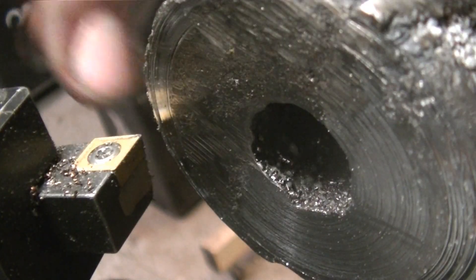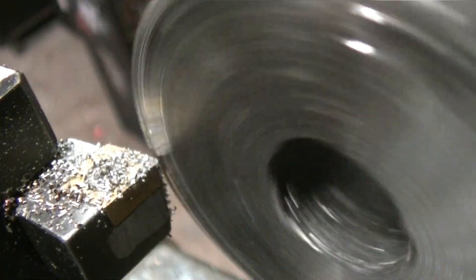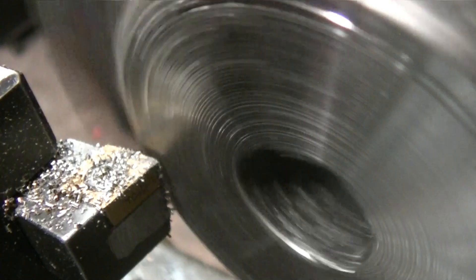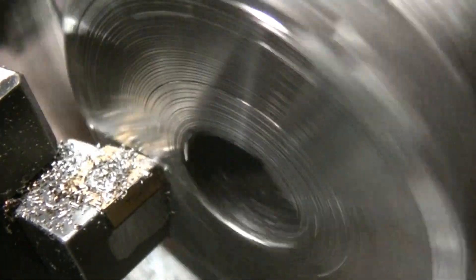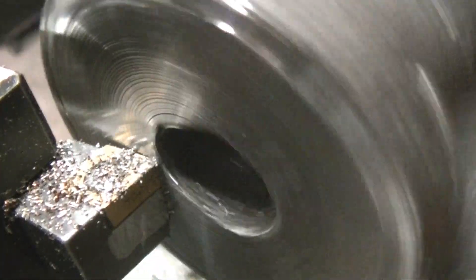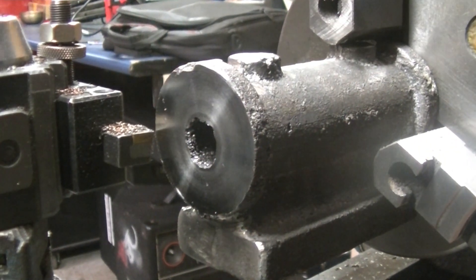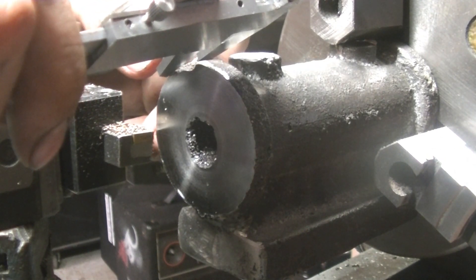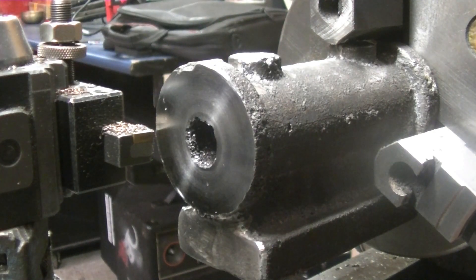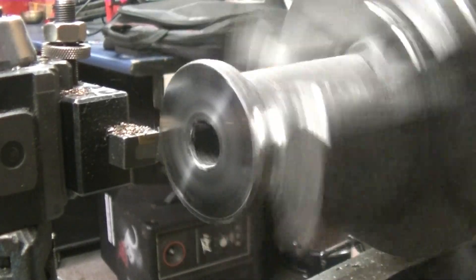That is too deep of a cut. So this hole in the middle is dancing around but what I care about is the trueness of the outside. It shows to be relatively true because I'm boring out that centerpiece - the only reason I put the core was just to make it so I can remove less material. I got it cleaned up but we've got to bring it down to a quarter of an inch, and right now we're at about a little over three-eighths, so we've got a decent amount to take off.